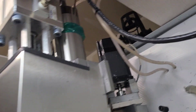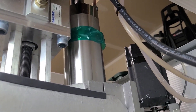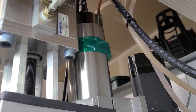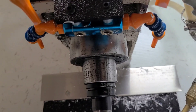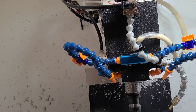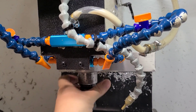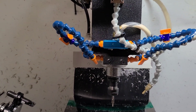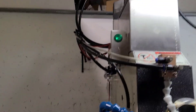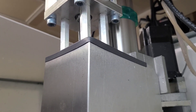What's really unique about this mill is the spindle motor is actually a CNC milling spindle — a 2.2 kilowatt, so three horsepower — and I made a custom pulley setup where it drives the Grizzly spindle. The Grizzly spindle is fitted with high-quality angular contact bearings, and when the mill sells I'll give you a full reference chart of all the parts so you can have replacements. The spindle has not acted up since I repacked it; it's probably been run for a couple hundred hours and it's still running very smooth, very quiet, and does not heat up. Being water-cooled, you can run it all day long.